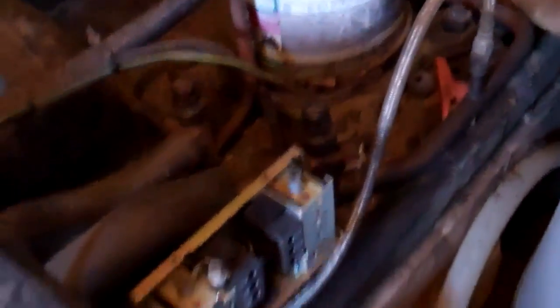I'm going to squirt some stuff in there just to see. Looks like we're going to want a dual pressure switch. It's tricky to get a light in there, but I can just about make out — it's just bubbling away at the bottom. So that's the problem: a leaky high pressure switch.